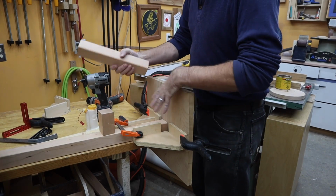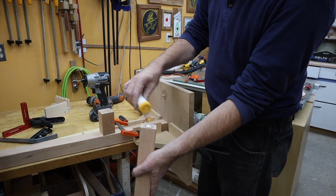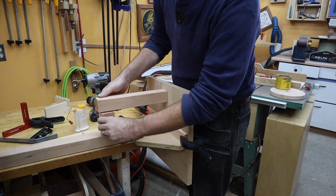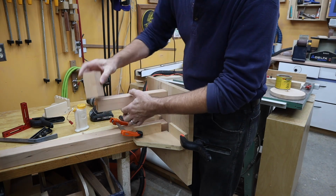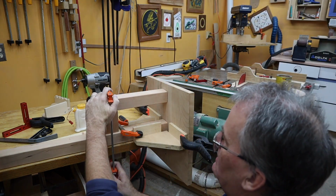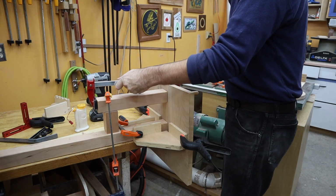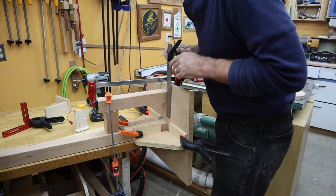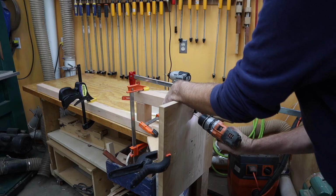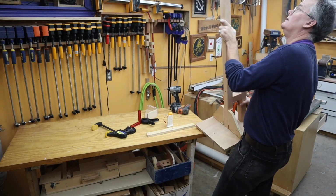So I'm going to leave this clamped in place, and I'm going to put on the first 10-inch post. Again, a bit of glue on the bottom. And I cut this spacer, which is the exact distance that this is to be away from the middle. And clamp from below, because I need some clearance. And then a long clamp here. Trying to squeeze up the bottom here. Can we see, is it still square? And again, I'm dipping it in the wax. That went way better than I was expecting.